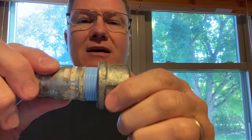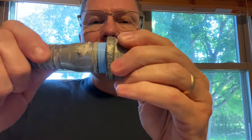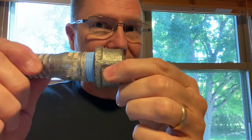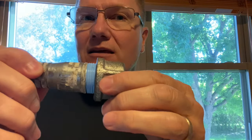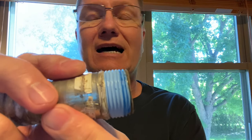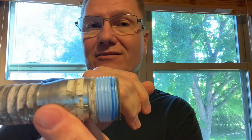Now if you go the wrong way as you're wrapping around, sometimes it'll be fine, but sometimes it will start to let loose. That's why having pressure on it and wrapping it around itself a couple of times is important. Now I can get it threaded and I can start to feel the Teflon tape impeding the action. As it goes farther in, it's a little thicker and it'll squeeze into those little grooves and seal up tremendously well.